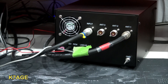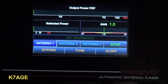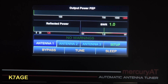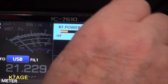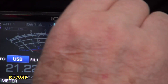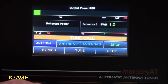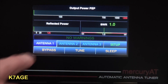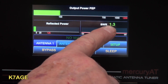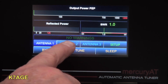The fan started up and it's beeping. Looking at the instructions for tuning with the transceiver control interface: place the amplifier in standby — I don't have one yet — make sure the bypass switch on the Mercury antenna tuner is turned off, and set the transceiver to 10 watts out. I'll use the multi knob on the 7610 and turn it down to about 10%. Then press the tune button — done. I'll run the power up to 100 and key up the radio. Power is 100, SWR is 1.3, and reflected power looks like about 4 watts. No warnings.